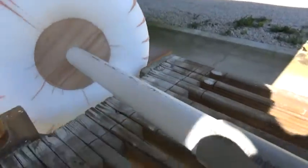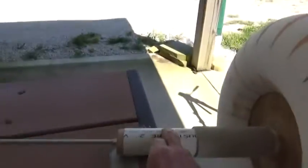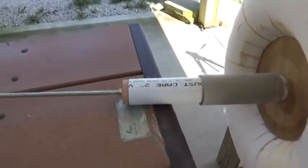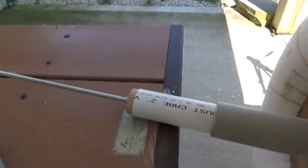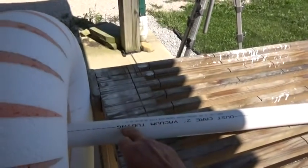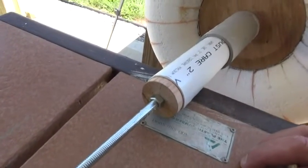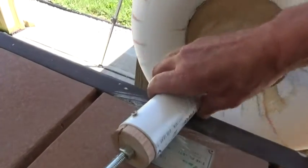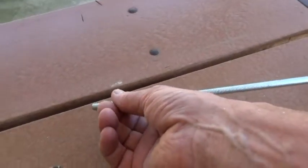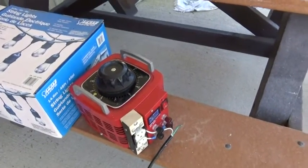As you can see, I'm just going to slide this right off the end here. It's just a piece of gray electrical PVC — this happens to be a piece of dust care two-inch central vacuum tubing. It's a very, very thin wall, as you can see. I've got a little wood plug in the end, and this wood plug is just sitting in here. I have a screw to hold it still, and then I just have a piece of threaded rod on here that attached to my drill and a variac, which allowed me to turn it at variable speeds.